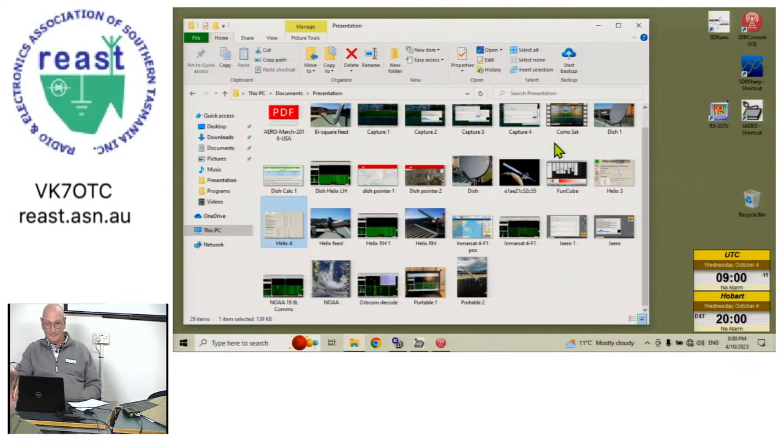Anyway, what else can I say? Are all the geostationary satellites north of us? Yeah, but most of them seem to be around the equator. I have another program, an online program, which I'm not online for at the moment, but it gives you all of the satellites that are available, and you just choose from them. Most of them seem to be over the horizon, and some get too low that you just can't get them. The elevation's only 2 or 3 degrees and things like that. So I've still got a lot of work to do, a lot of tinkering around.